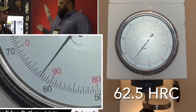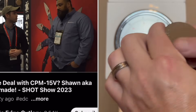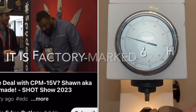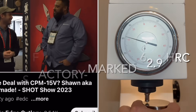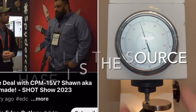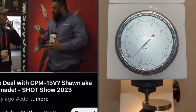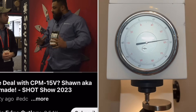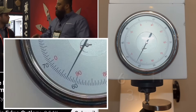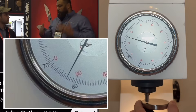Were you surprised by just how well the sprint runs have done? Honestly, you have no idea how a sprint's going to do until it's done. The support has been extraordinary. All I had to focus on was doing my part of the job, which was making sure that the heat treatment was where it had to be — doing extensive testing with how it was sharpening, going back sometimes if things weren't being done right to correct them, and confirming the hardness would be where we wanted it to be.